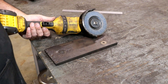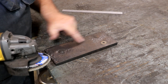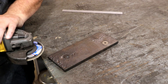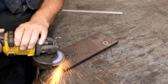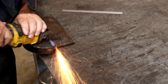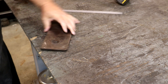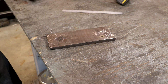I've got a flap disc on the angle grinder, and it doesn't need a bunch. I'm going to avoid hitting the originally ground areas — I just want to get everything down below them, knock off the high spots. I think that should do it. I'll go over to my surface plate and check that real quick, but I think that's going to be all we need.